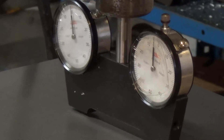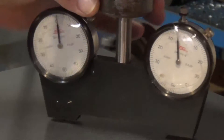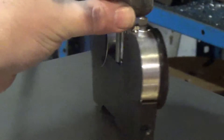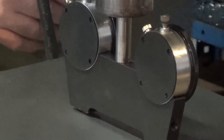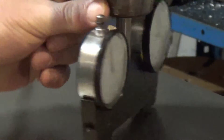We're at zero on one side and about three thousandths out the other way. I'm going to rotate the head in that direction — we're about three thousandths out that way. To verify it, I'll turn it 180 degrees: zero and three thousandths. So everything is correct — it shows it both ways.